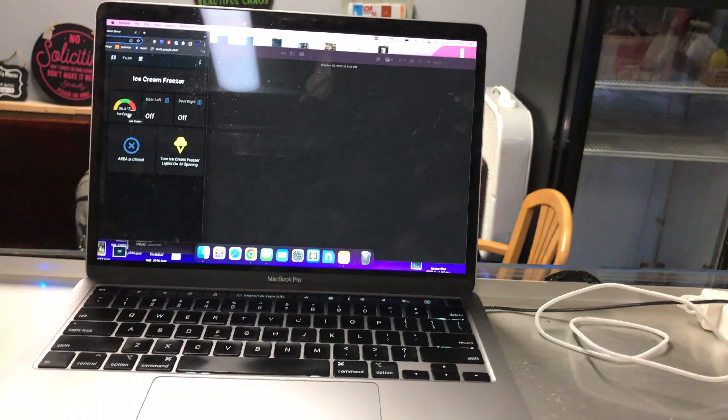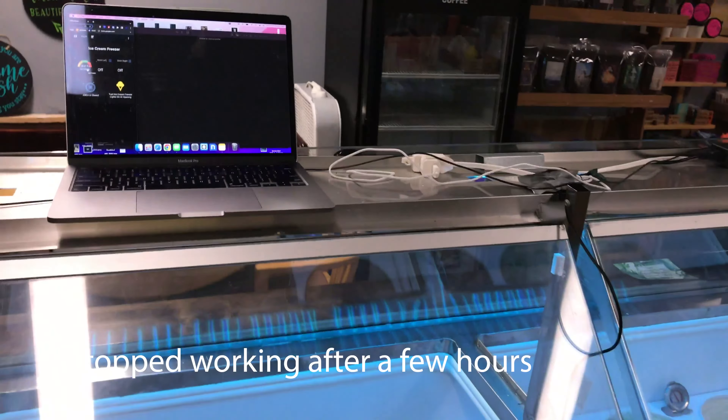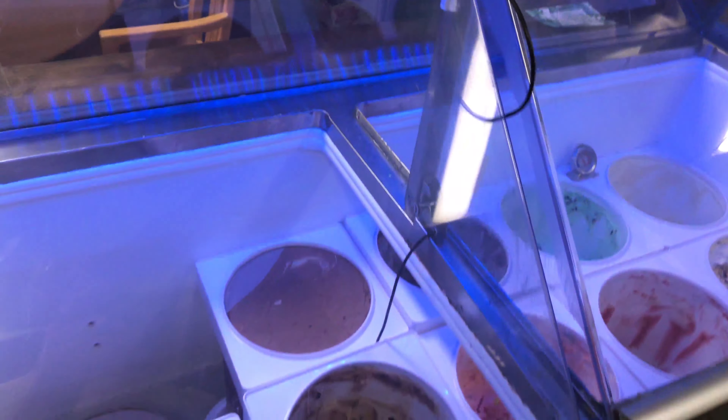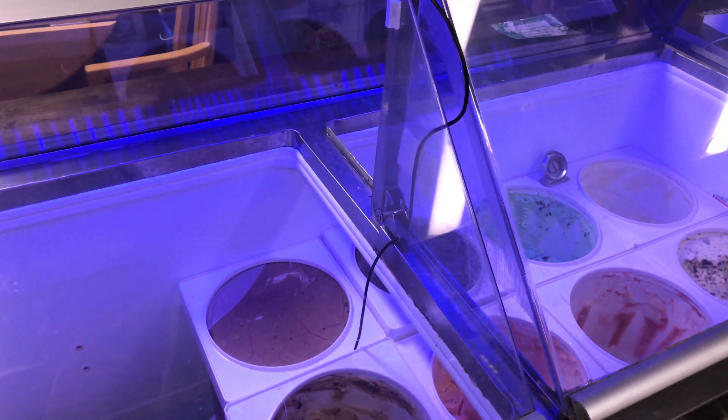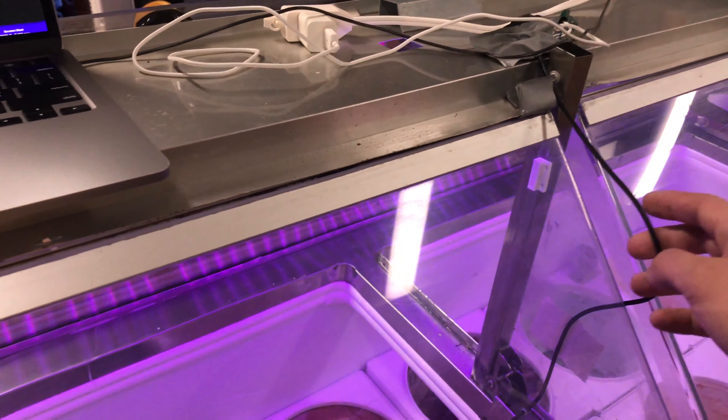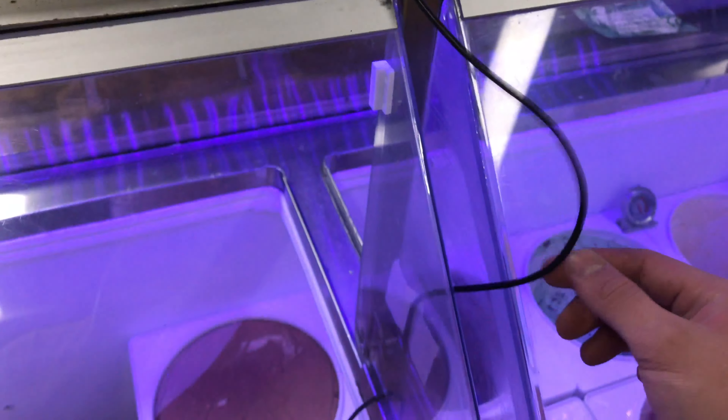I also have a backup in there because of a problem I found. I've had this system running for a while — I apparently bought a cheap knockoff sensor. It will probably work for a week or two and then the sensor will just stop working and become unavailable in Home Assistant. Tasmota doesn't even pick it up anymore. I'll power cycle it a bunch of times and it may come back online, but every two weeks it just stops again. I googled it — apparently I bought counterfeits. So I guess that means buy from legit suppliers.